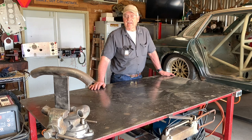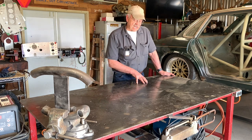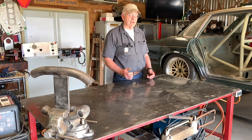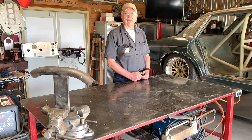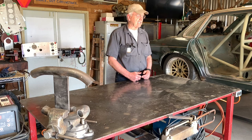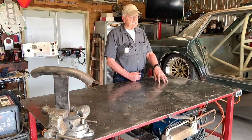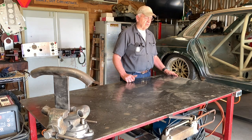I bought hot rolled steel because it was cheaper than cold rolled steel, but I would come to appreciate it later. The scale on hot rolled steel tends to repel the spatter. I've got a broad chisel that I use to just rake over the top of it, and generally the stuff pops right off. Some cases you have to do a little grinding, but usually it just scrapes right away. The other thing is that the scale on the outside seems to prevent rust. If rust occurs on this bench, it's usually in an area where I've had to do some grinding.